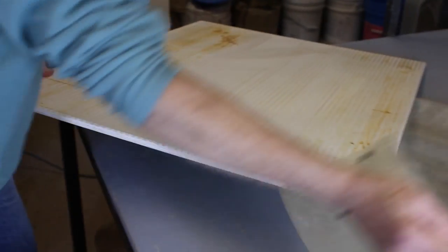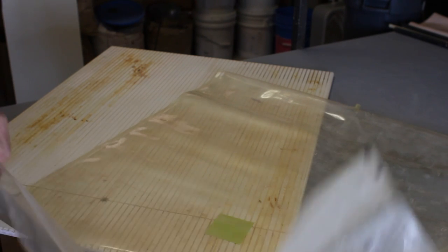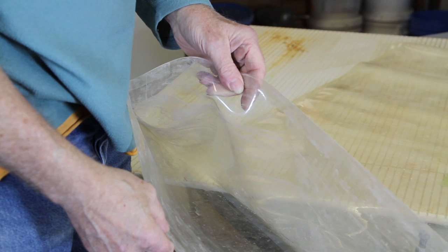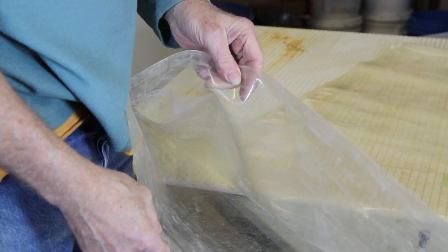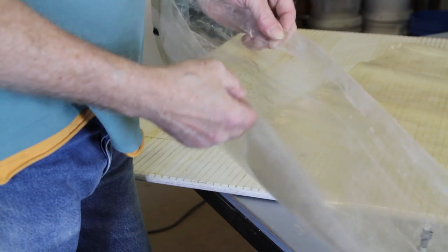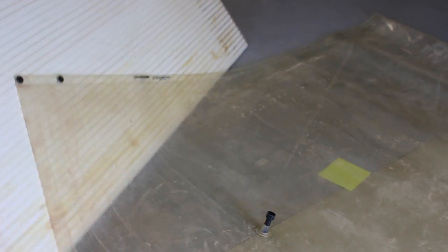These are basically pathways to bleed the water off from this slip. I'm going to put this inside this vacuum bag. This is a vacuum bag from a supplier who supplies the woodworking industry — woodworkers use vacuum bag technology to bring freeform shaped veneers down on a mold for gluing purposes. It's an industrial quality, very heavy plastic film designed for vacuum bagging, fuse-welded around the outside edges, made up to a particular size. I'm going to insert the Marine Board inside the bag.